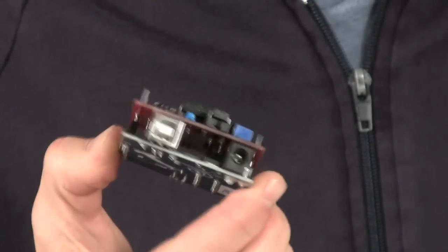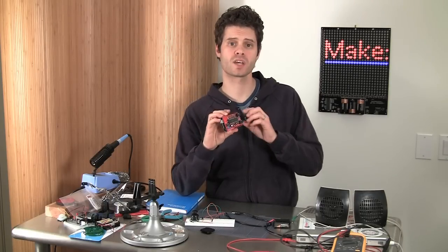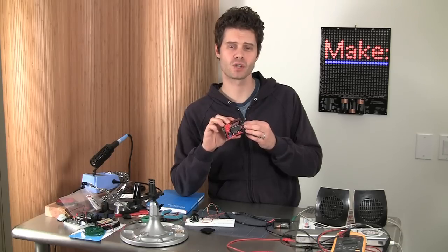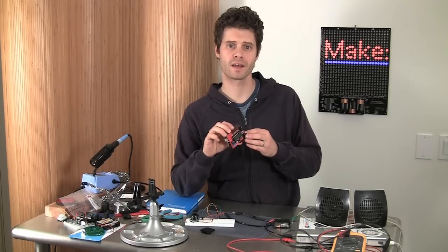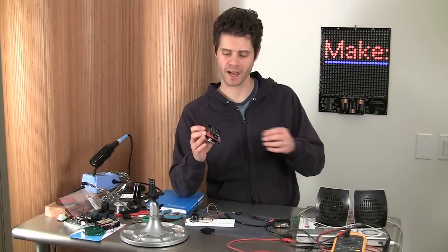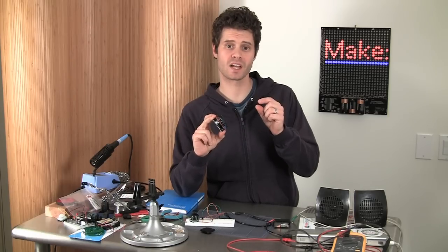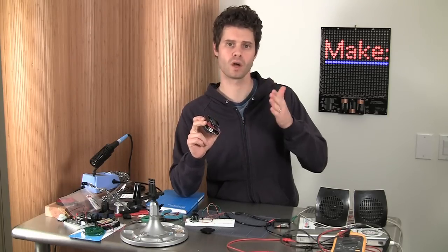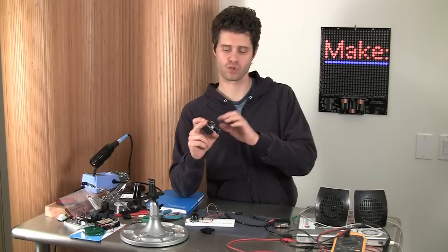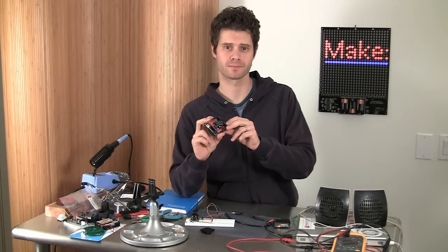What you do next is plug in the Arduino to the USB on your computer. What I did was I recorded some audio files using GarageBand on my Mac, but you could use Audacity, which is a free, really good sound editor, or any other application. Or you can use MP3s that you have pre-existing, WAV files, AIFs. Get them on there, and then you'll address each of those little sound slots from the software. So you could say the number 1, 2, 3, 4, and have this play back 1, 2, 3, 4, or trigger those sounds from buttons or knobs or other types of input devices.